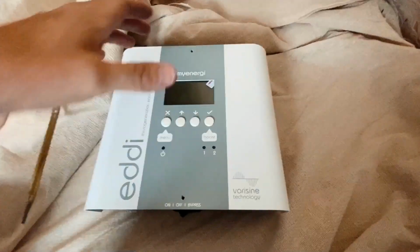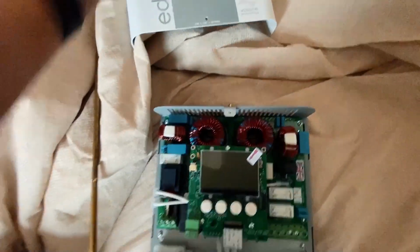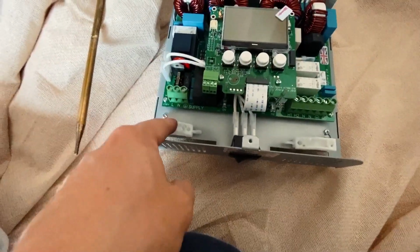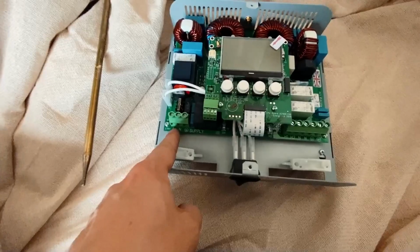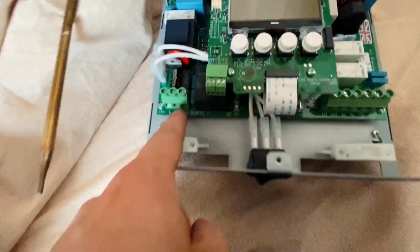I thought I might show you just what's inside these as well, because I've never done one of these before on my channel. Very, very simple, very easy to install. You've got a supply side here with your cable grip there. So you literally take your live, neutral and CPC into those terminals. So that's the feed in.